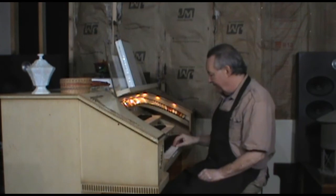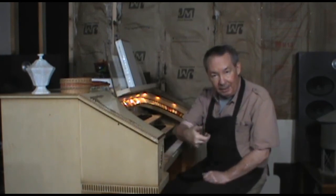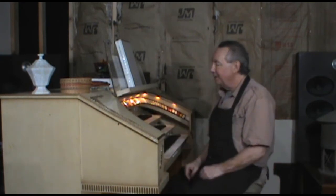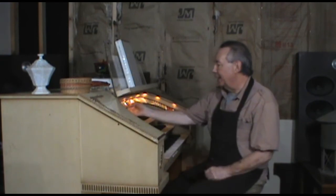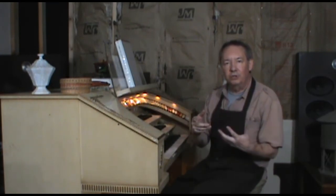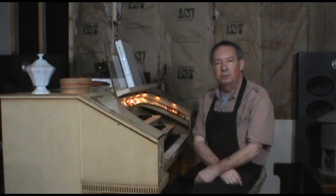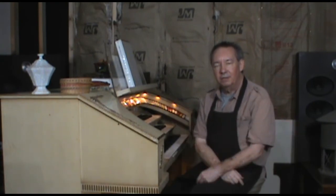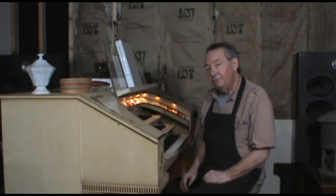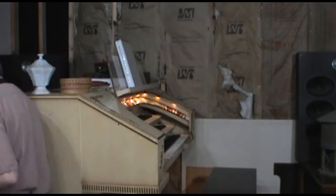The traps, on the other hand, are turned all the way up, and I have the traps forte stop on just to get anything at all out of it. So that could be as simple as putting a smaller resistor on that output resistor. I had to do that on some of the other circuits, the output resistor going from the filter circuit to the bus. On several stops, I put in smaller resistors so that I could get the stops to balance out correctly. That's obviously not a very difficult thing to do. But that apparently is going to be our next video, making the trap circuits all work correctly with the piano. And then I wanted to show you this.